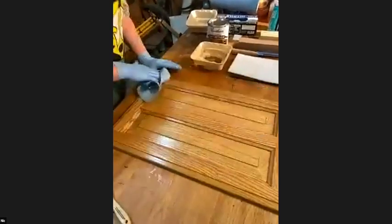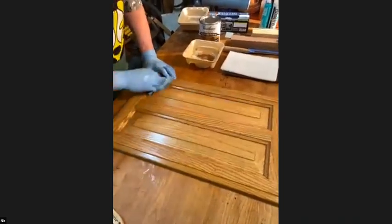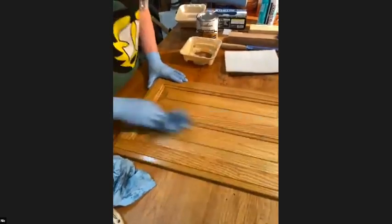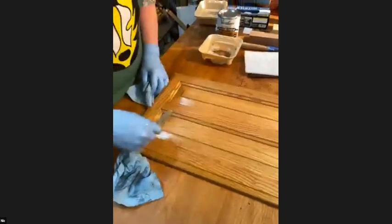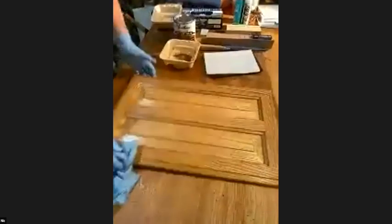You end up with a polyurethane finish which is a rather durable finish. Very little time, very little effort, no sanding, a nice smooth finish — nice, even, uniform. If you have problems in corners, get your brush in there, wipe your brush, pull out the excess.